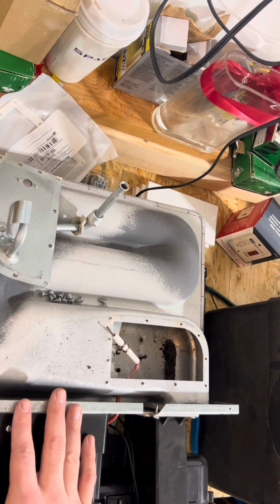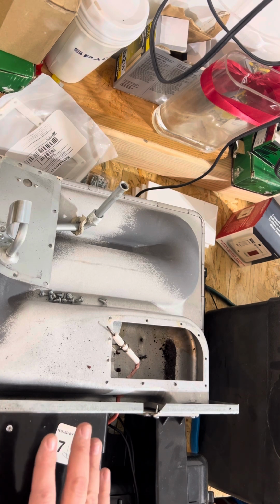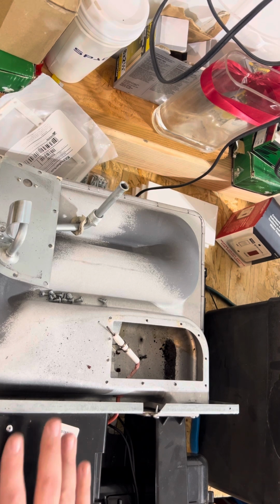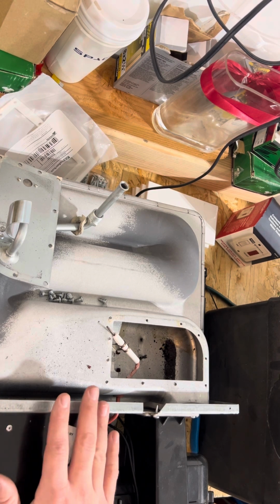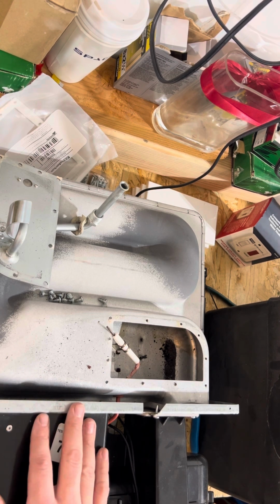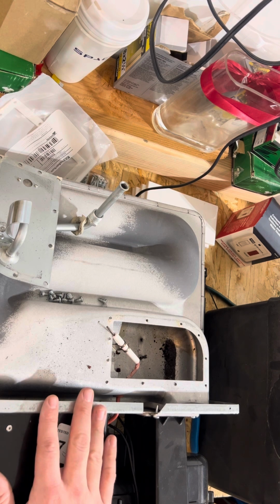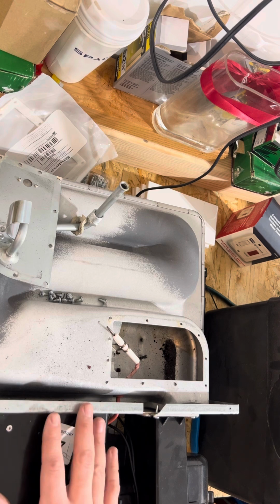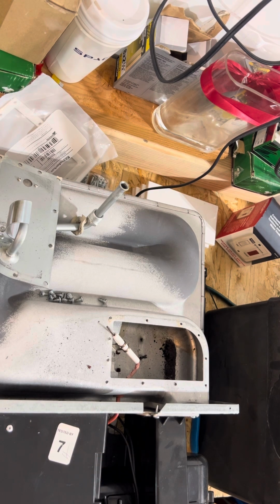And if you're replacing a 42,000 BTU RV furnace for a Suburban, the replacement core only goes up to 35,000 BTUs, but it is comparable, and that is why Suburban allows you to replace a SF42 with a 35,000 BTU Suburban core replacement. On Suburban's website, they have a chart where you can look and see which furnace you need based on the model you currently have already. So that being said, I will post a link to that as well down in the description.